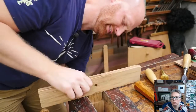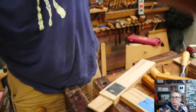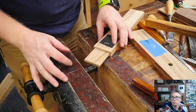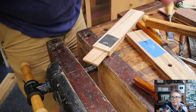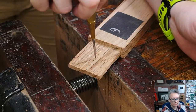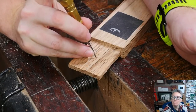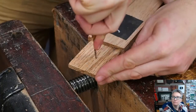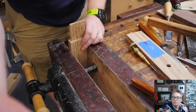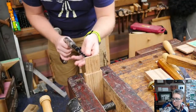Now we're going to take it apart one more time — one of the reasons you want that fit to be a little bit loose. This is the most important step of everything in the drawbore tenon. I'm going to grab my awl, find that dimple, and instead of drilling right there I'm going to move it towards the shoulder — because it's good hardwood, a little more than a sixteenth, not quite an eighth. I'll put a new hole right there, make it a good heavy hole.